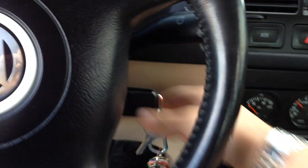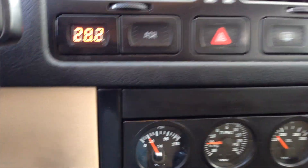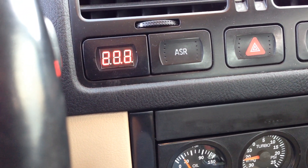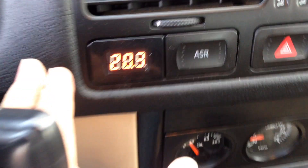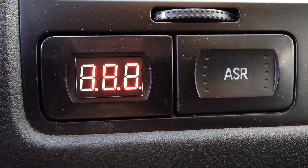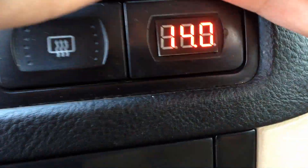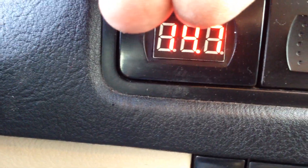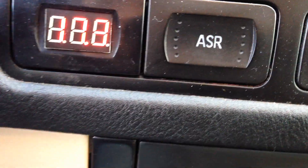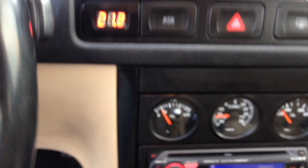Let me start it up so you can see it running real quick. Hopefully you'll be able to see the amp draw here. Okay, let me turn it down just a tad. The electrolyte is pretty warm right now. Right there we're at 20 amps — sorry, the glare is kind of hard to see. It's reading 19.47, around 19 amps, 14 volts. It's reading 16, 14, 18 — it jumps around a little bit, especially when it's just idling. I like to keep it around 20, just so I don't get the system too hot.